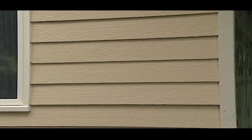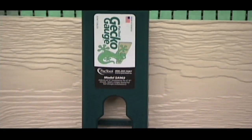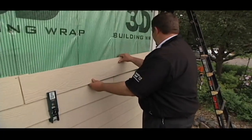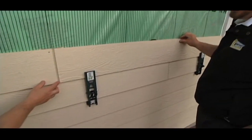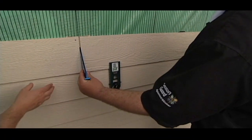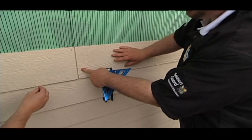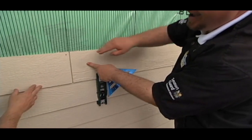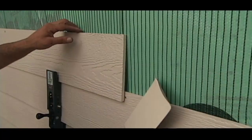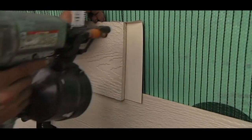You want to make sure everything is all uniform and matching. These are little tools that we use so we get the proper reveal on our siding — makes it nice and slick, just sits in there. We use a normal speed square to get our spacing system in there. With the LP, over time it will swell and won't contract, so the seam will go away. What we've done differently is our slip sheet is actually a piece of color-matched aluminum, so it really does blend in when you stand back and look at it from the wall.